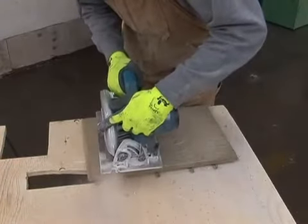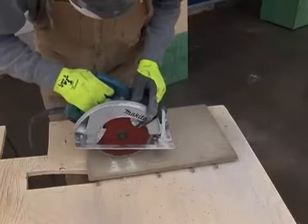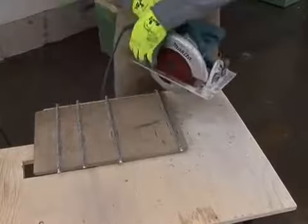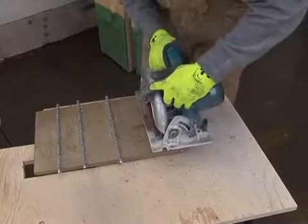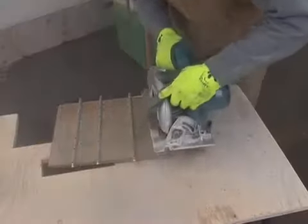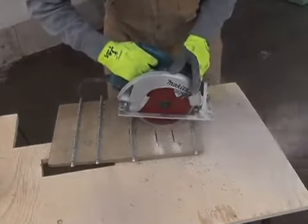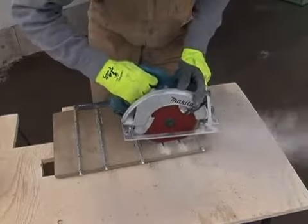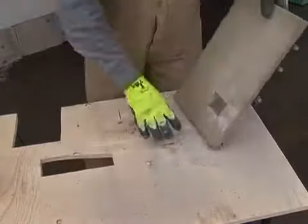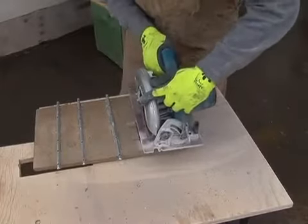Cut the left and the right side of the square electrical outlet hole and finish it from the back side. You may need to mark the back side if the blade has not made it all the way through. Extend your cut on the back side long enough to allow the concrete piece to fall out. If you grind this part out a little more, the screws of the plug will have enough room.